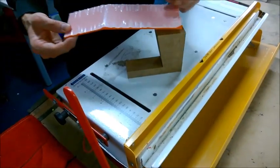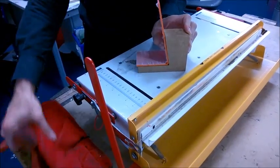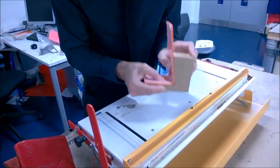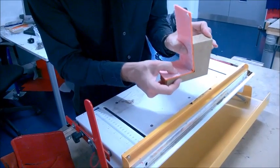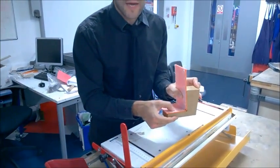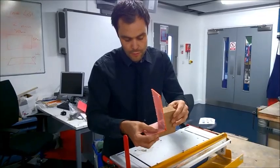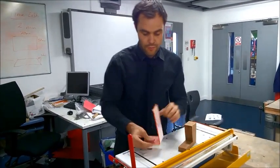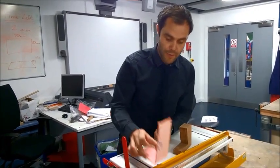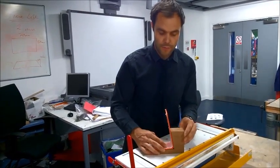I've got to be quite quick at this stage. I'm going to use my jig — just pre-bend it and slide it into the jig so I'm holding it in place. At this point you might wish to put some gauntlets on if you're going to be touching the hot area. Because I'm quite well-versed with this, I'm just going to hold it in the two positions here to support it so it can't move, ensuring it will be in the right position. I've just got to hold this for around about a minute and it will be cool. We'll know it's set if I take it apart and it doesn't spring back to its original shape. There we go — we've got a firm piece. It's been set in that position. If I did make an error, I could put it back over the heat and due to its plastic memory it would reform. But once I've done my first bend, I'm ready to do the next one.